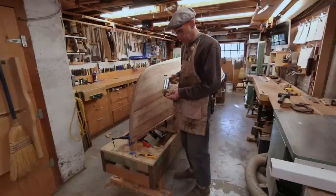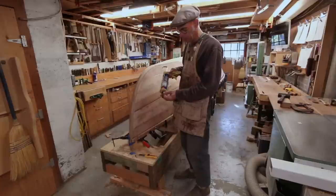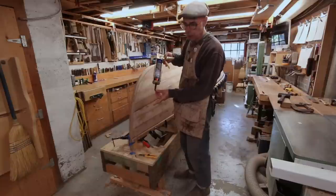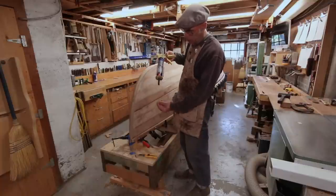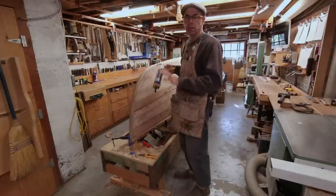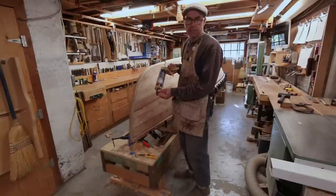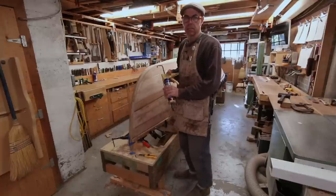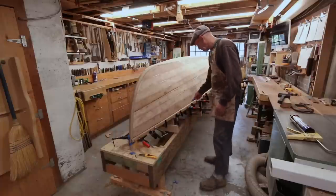The tube was about three-quarters full and I didn't want it to go to waste. Once you crack it open it has a pretty limited shelf life, and putting rubber caps on the ends doesn't really keep it from kicking off. The best thing I've found is to squeeze out a noodle and leave it hanging — it creates its own seal. But I'd say you've got to be using it again within about a week; beyond that the cure will creep in and you're done.